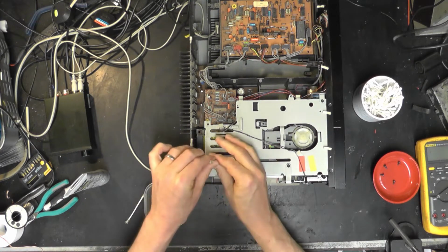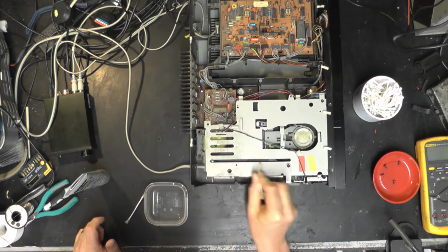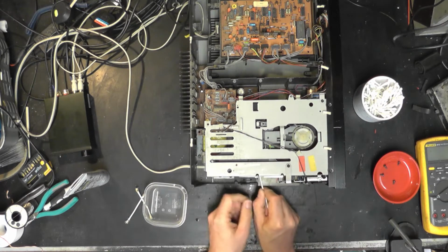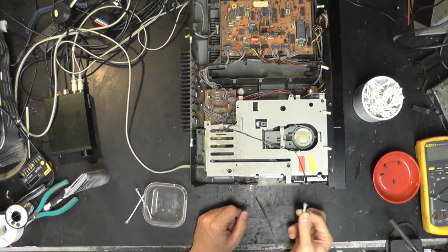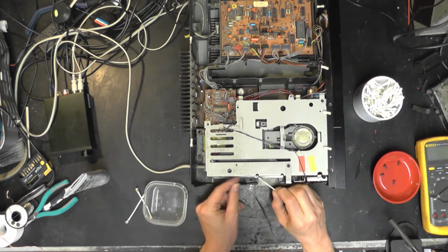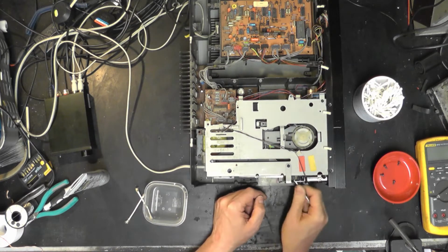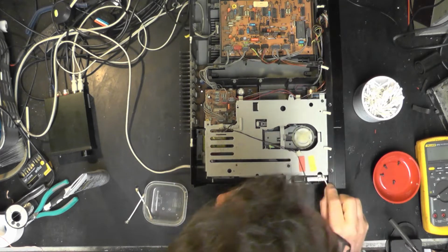I reckon that that belt's been done before, you know, hence it's an odd colour, because the original Philips belt was almost certainly black. On Philips belts, they do have a habit of turning into a nasty sticky mess. If you follow the website, you'll know that, because we've done many of them. Let's get all this cleaned up, free all these mechanical parts off. I'm trying to get away with a minimum amount of disassembly here. I don't think there's any need to go mad with it.